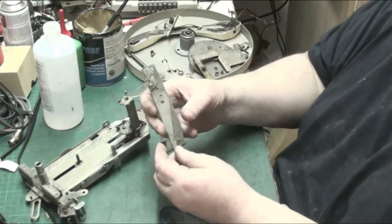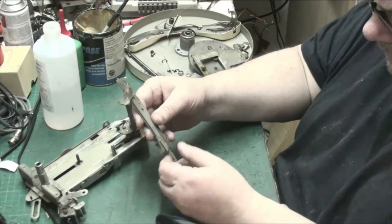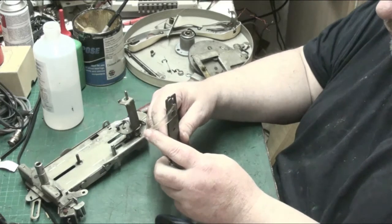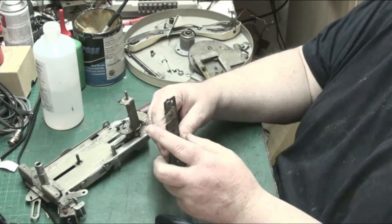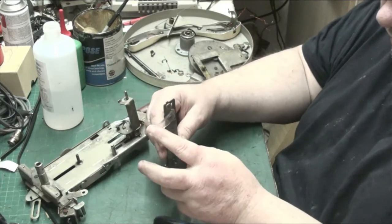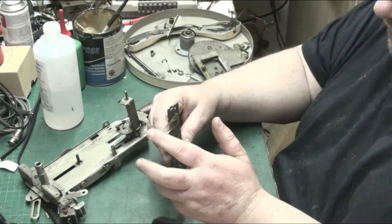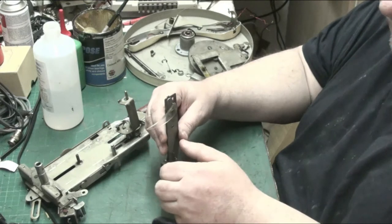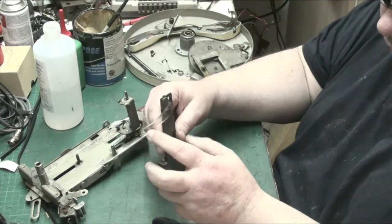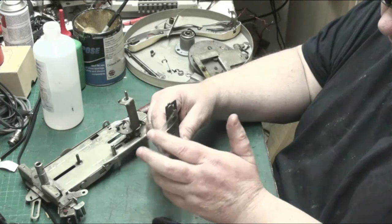Now, simple in its operation, but effective. Basically, in 45 RPM, a 7-inch mode, nothing hits this. So the arm will go over, this won't move. 10-inch, set to 78, just clacks, or the 10-inch, whatever it is, hits it one notch and moves the arm over. For 12-inch, it hits it a bit further up there.